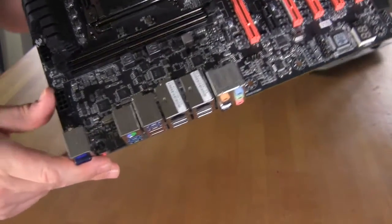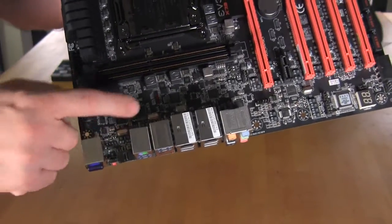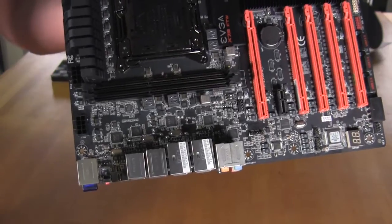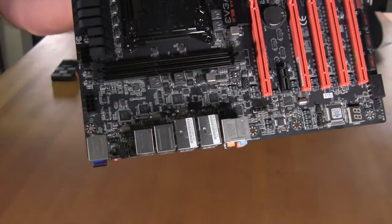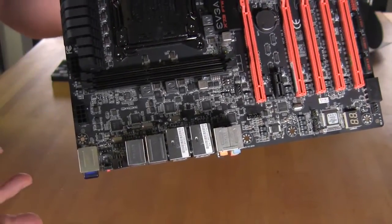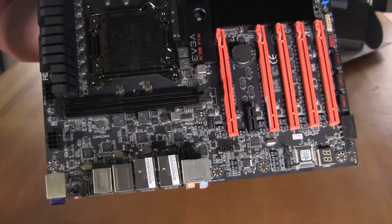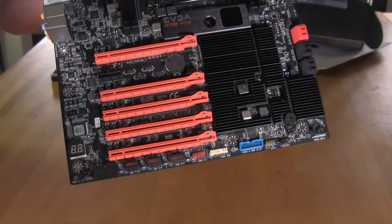Taking a quick turn and talking about something a little bit different: if you look, you have two small chips here that say VLI on them. What they are is a USB 3.0 hub. Each one of these is capable of taking a single USB connection and turning it into four ports, and that's going to play into the number of USB 3.0 ports that we see on this board. We'll take a quarter turn here and look at our peripherals.